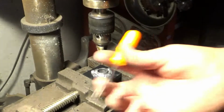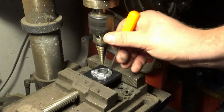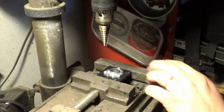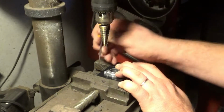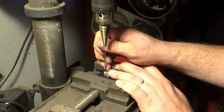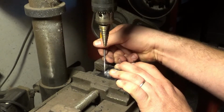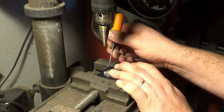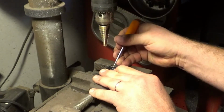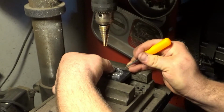Now, what you're going to want to do is take a pick, and you could trace around the outside of it, just leaving little scratches. Also get down in the 3 mounting holes, and then we can drill out the holes. It's going to be kind of hard to film this part, but you just hold down in a couple different places. Get the first hole. It already moved on me a little bit. Get the outer edge. Don't have to scratch terribly hard. Make sure to get the locating indentions. This plastic's really easy to scratch, so just a light gliding over the surface.